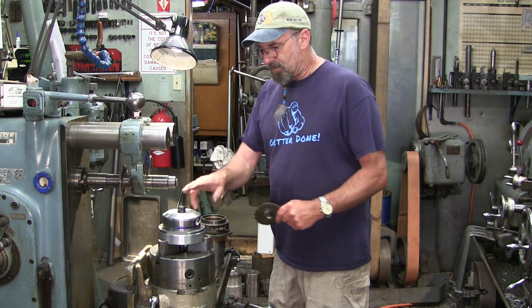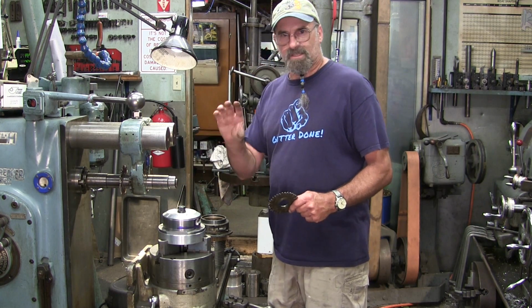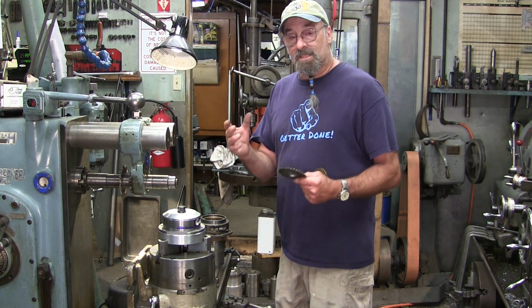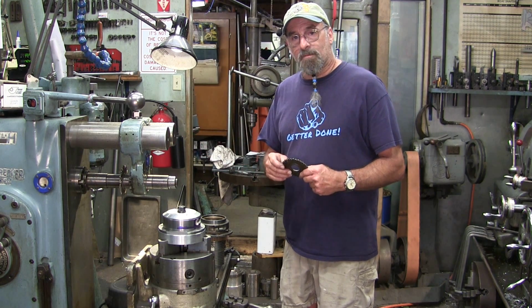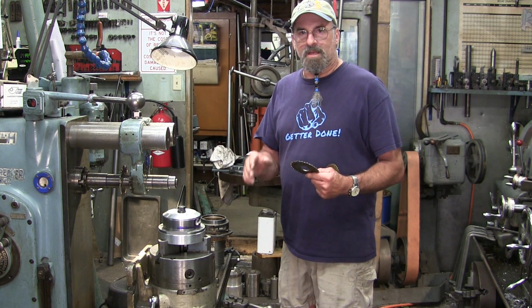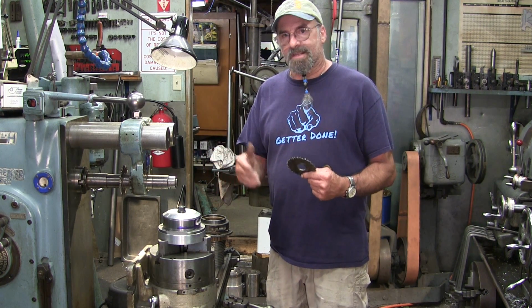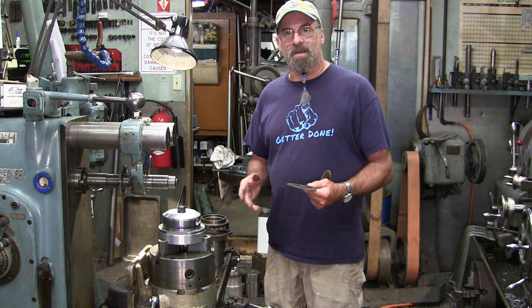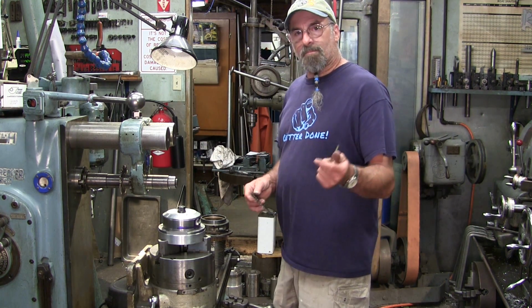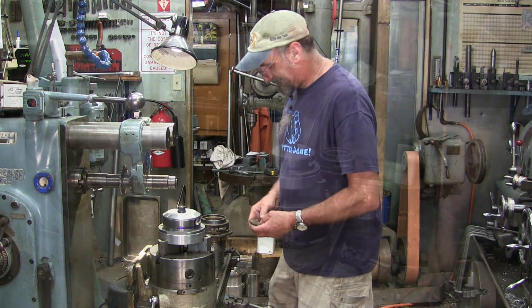But we're going to be changing it up. We're going to be pulling this off of here, but we're going to set up with some machinist clamps, and we're going to be squeezing and holding this thing together. It's going to be on the mandrel, so all the pressure is pushing sideways on the mandrel and not really creating lift of your part. That's the name of this game that I'm playing with, setting up and cutting this groove. So let me bring you in close, and I'm going to start getting this all set up.